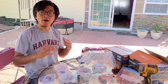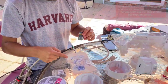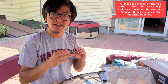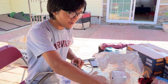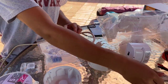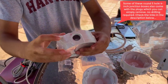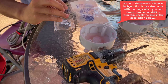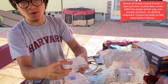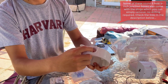It's very important that you make sure these are watertight because they're going to be used outdoors, which is why it's important to get the right connector — this one will make it a watertight connection. For example, the metal clamp connectors are not watertight, so don't use those. If you get a junction box with holes, you'd have to put covers on them to make them watertight. I would recommend getting a junction box that is already covered, where the holes are already covered and all you have to do is drill to open them up.